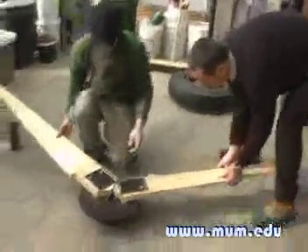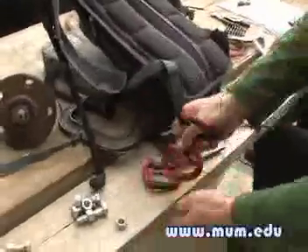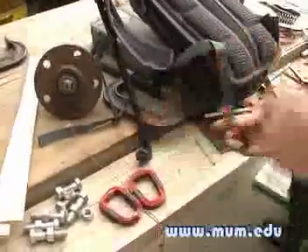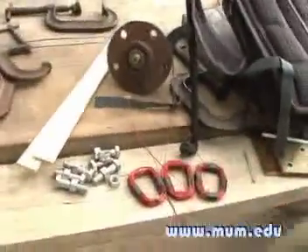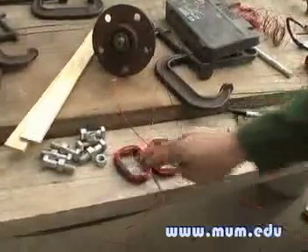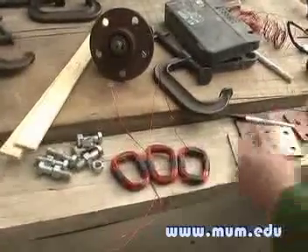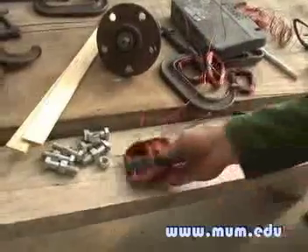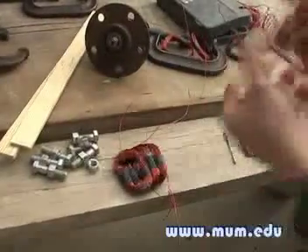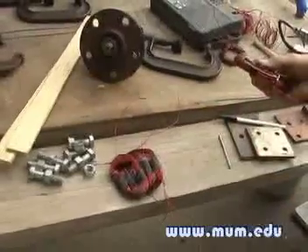Here's what the eventual size of it's going to be — that's the blade diameter. We've been doing a kind of innovation ourselves, which is that typically these coils will be arranged like this, which is fine, it's a really simple design. But you have a lot of gap here, basically, so you're wasting all this potential. So what we're doing is a system where we have the coils overlap like this. You can actually squish them so they take up the same amount of room, but they basically have double the amount of copper.